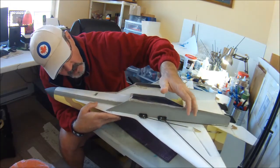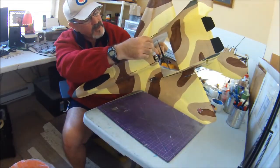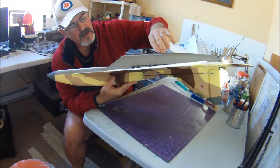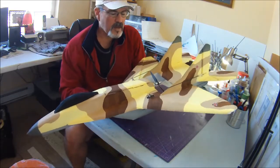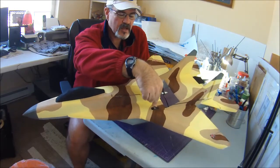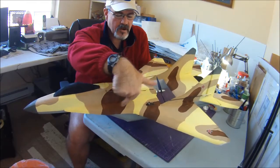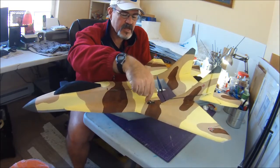If you put the servo the other way, then your wire is going to be awfully close to the prop slot here. So orienting your servo so that the wire is this way makes it a lot easier, and then the wire going that way on the aileron servo. And then for the rudder servos, again, I put it so that your rudder servo is coming down into the nacelle between your elevon servos right here, your aileron servos right here. So I put the wire again facing forward so that it has less distance to travel.